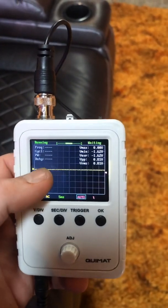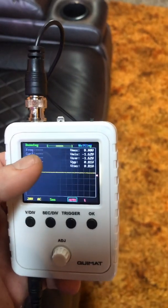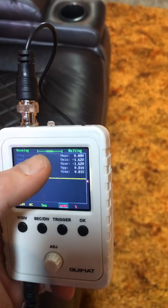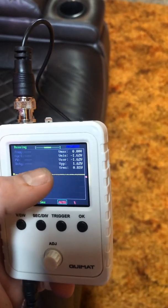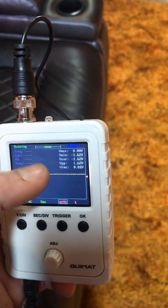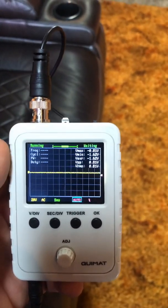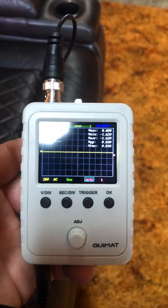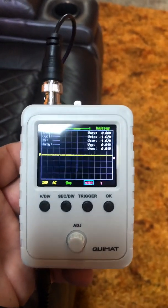It's pretty straightforward — you'll see the sine wave come up across the screen. You hit clip once the wave goes up, flattens off, and comes back down. Back the gain down just a hair so it's perfectly round, and you know you've got maximum output with a clean signal. You can also use it to find the clip point on your radio.